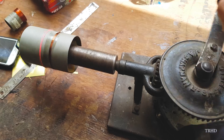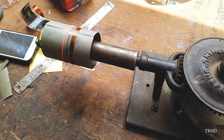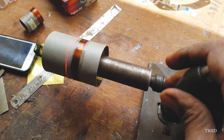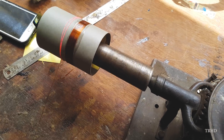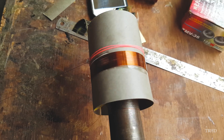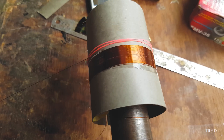For different speakers with different specifications you have to use different gauges of copper wire, and also the number of turns differs based on the requirement. In this video, the coil being shown is used in an 8 ohm 300 watt speaker — it's a full range speaker used in PA systems.